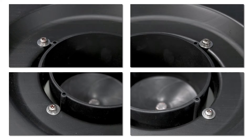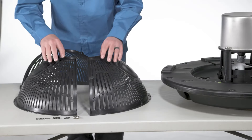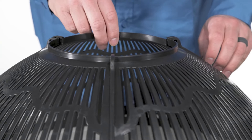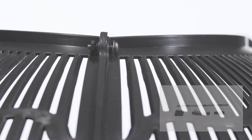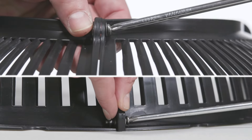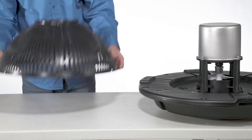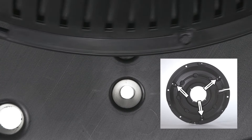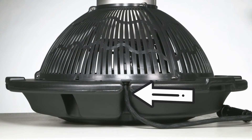This next step you may need assistance from a friend. Carefully flip the fountain upside down so the float is on the bottom and the canister is on top. Grab your screen sections and one by one align them together on your table or work area. Then start placing your number eight hardware through the pre-drilled holes on the top and bottom of each section. With your number two Phillips head screwdriver, go around and tighten all the number eight hardware around the bottom screen.